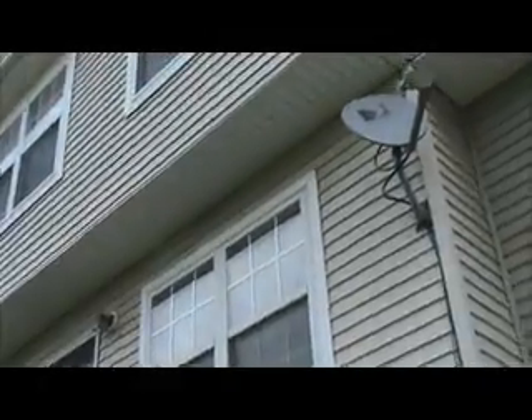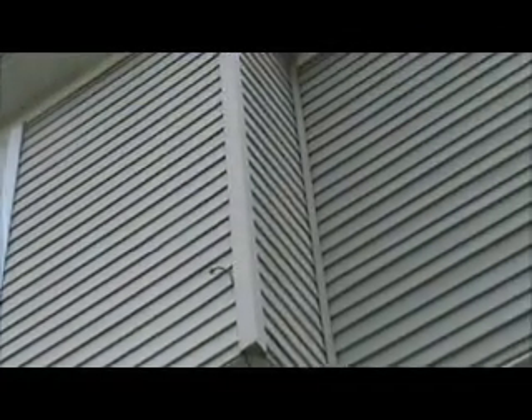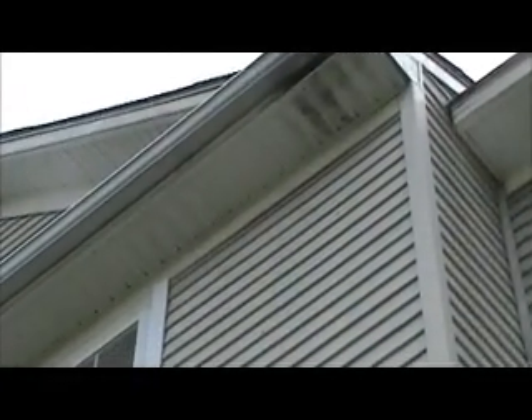This is the rear. We've got to take the gutter down, put a new piece of fascia wood up under there, and fix that with a new piece of primed fascia. Then when we're done with that, we've got to come over here and put a corner piece of wood in, fix the fascia on this end, and then put the old gutter back.